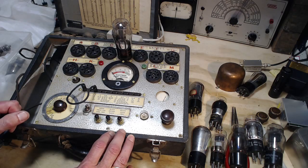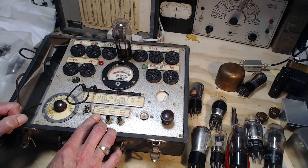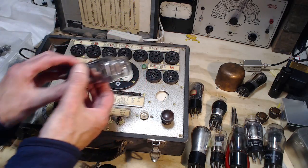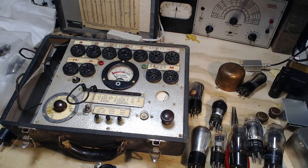Now the last tube — this is the one I can't find any writing on. The radio is calling for a 226, the same as these other three tubes I just did. If we compare what we can see through the glass, they look identical inside. Even though the glass globe is different, the internal construction is different too: the whole element inside this glass bulb is mechanically unsupported except at the base. With this shaped tube, when they narrow down the top all they've done is squeezed in the top. Then they use the mica sheet in there to go out and touch the glass — that provides stability at the top. Much improved tube, probably much less microphonic. So it's a 226 also. 226, D, 1.5, 67. Short test — no shorts. Very good. Not too surprising — this has got to be the newest one of all those bulbs.